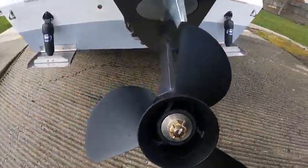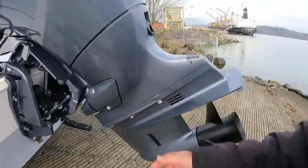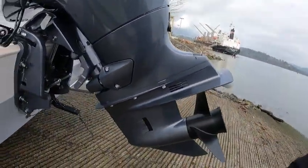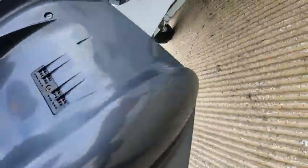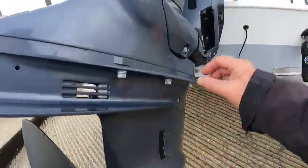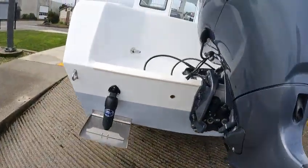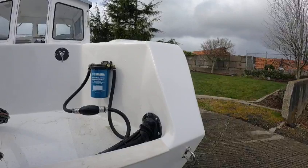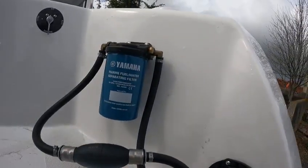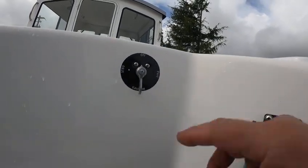15-pitch right-hand rotation stainless prop, shaft drive. Oil change right here, drain it right out here. Gear oil is down here in the bottom right here, and your check is right here — just pull that out and put a zip tie down there. If it's down like that you're fine, but you don't want it down too far. Stick with the Yamaha filter — the better filters, changing once a year.